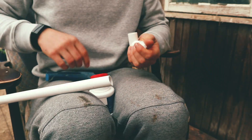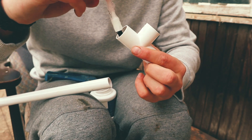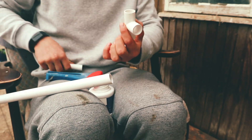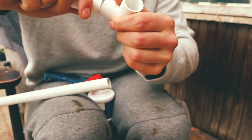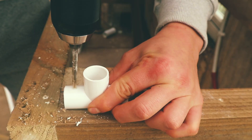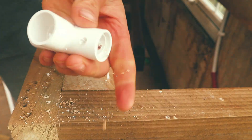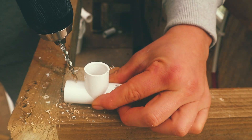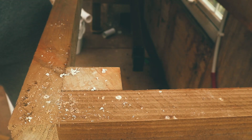You're going to need four of these to make the lighting bracket. Take your drill and drill two holes into each T section, trying to make them as straight as possible — this is where the screws will go through to fix your lighting bracket to the wall.